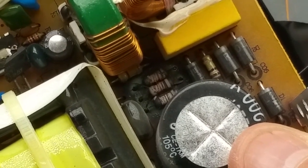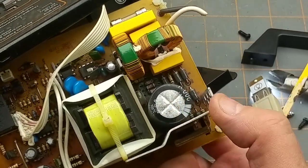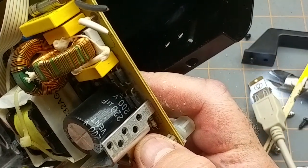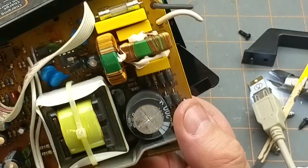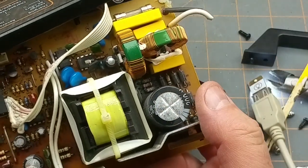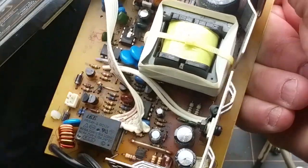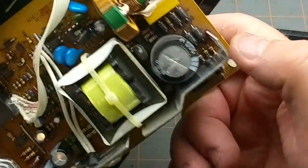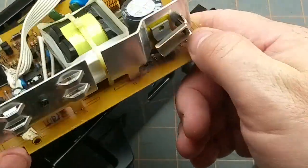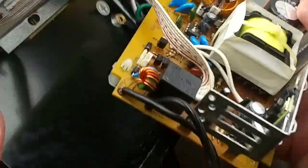Obviously she's hooped. I don't know what components are going to be worth salvaging out of this, if any. Maybe a 220 microfarad 200-volt capacitor, the fuse if it's still intact, inductors probably aren't hosed, and there's a relay over there that's probably good. Other than that — power cord, some nuts and bolts, heat sinks I'll probably grab, but there's not going to be an awful lot of salvage value in this thing.